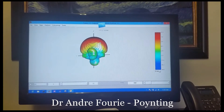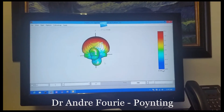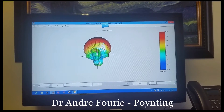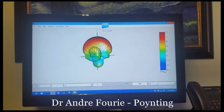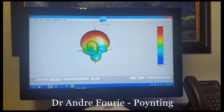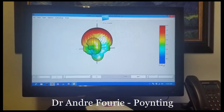The side lobes that you can see are actually low — anything green is at about minus 7 dBi, so about 15 dB down on the main beam. Even though they look big in the picture, they're quite small. At the top of the 1800–1900 band, gain is 11 dBi and the pattern is beautifully maintained with both antennas.